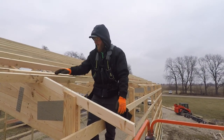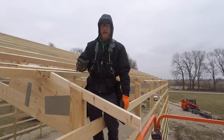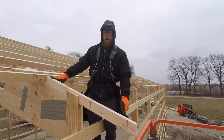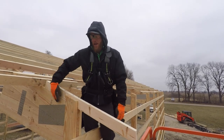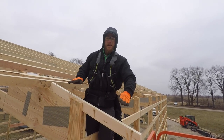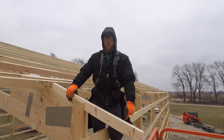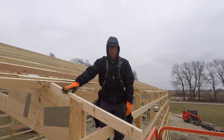That's solid. I know these 60s seem like just two nails is all that's gonna hold this thing up, but you gotta remember two things. First off, these 60 ring shanks are not easy to pull. I promise you, if you've ever tried, coming out of southern yellow pine wood. And then also, once our steel gets laid on top, that adds a lot of rigidity as well on the uplift force. So that's it, sub fascia, and we're ready for soffits and fascia.